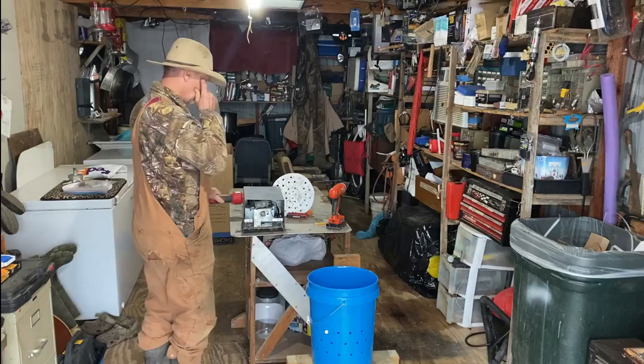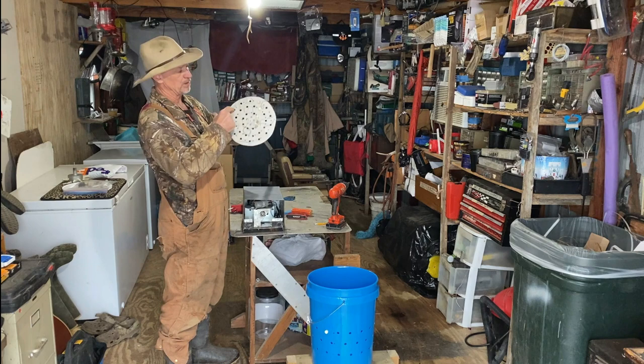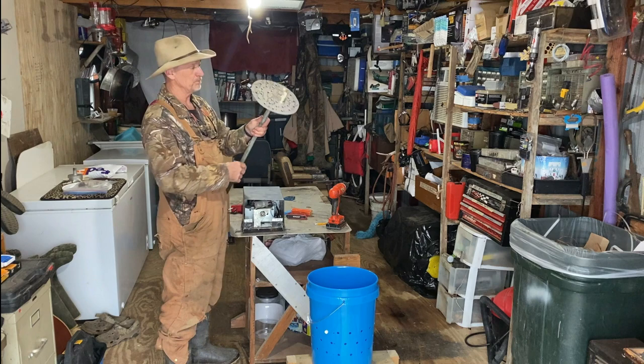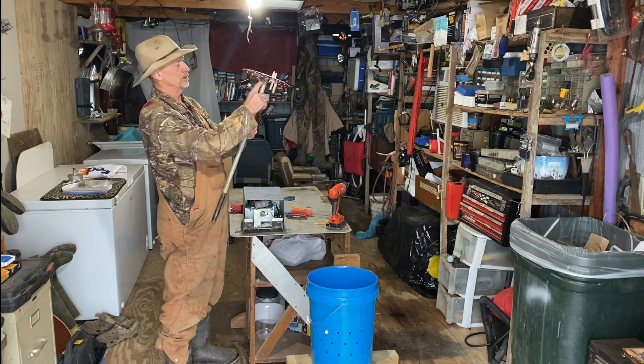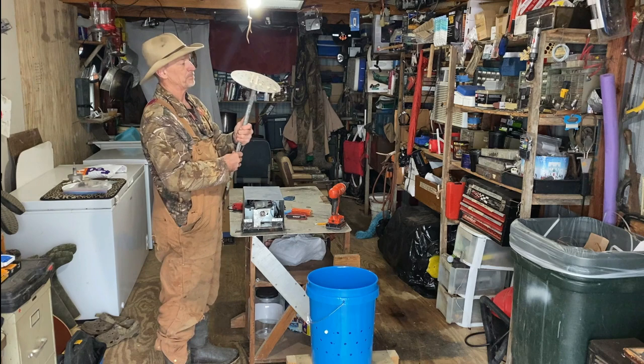All right, guys. At this point, I got my plate made, my holes drilled in it. Started putting some of my fingers in it just so I could adjust my height on my bucket. Got my shaft. I had to weld a big washer on top of this pipe shaft and drilled holes and put 4 little bolts in there. And that's how my plate's fastened to my shaft.